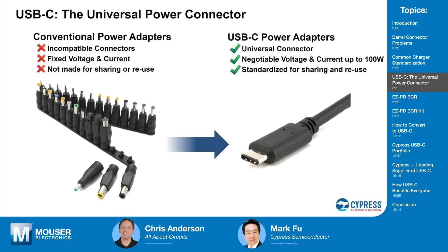On top of that, USB has always provided power from day one. In USB 2.0 days that was 5 volts and 500 milliamps; in USB 3.0 that was upgraded to 5 volts and 900 milliamps; and for dedicated USB charging devices they can draw up to 1.5 amps — so 7.5 watts total from a standard USB port. With USB Type-C supporting the new Power Delivery standard, that 7.5 watts is upgraded to 100 watts at 20 volts and 5 amps — a huge upgrade.